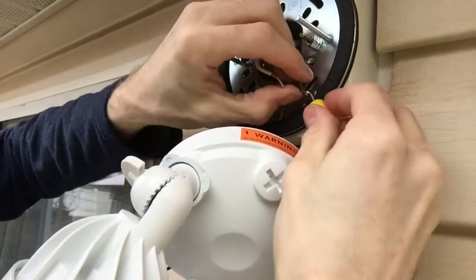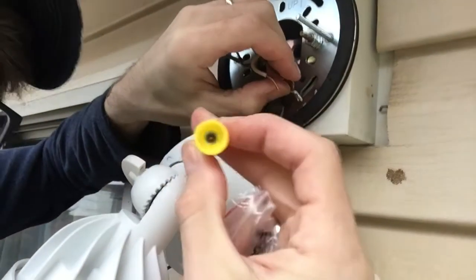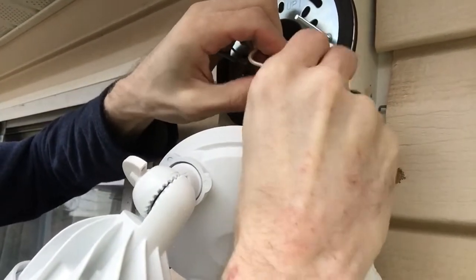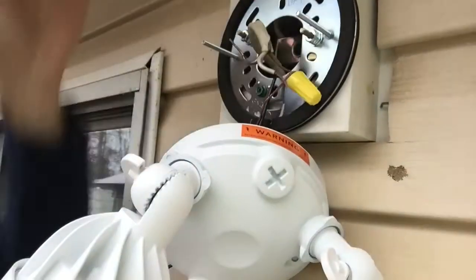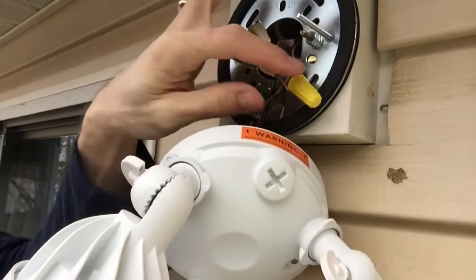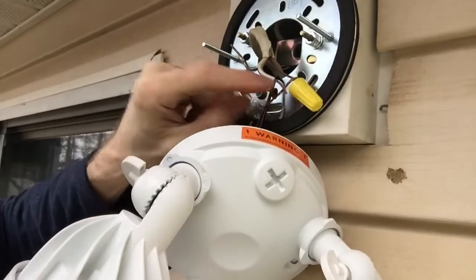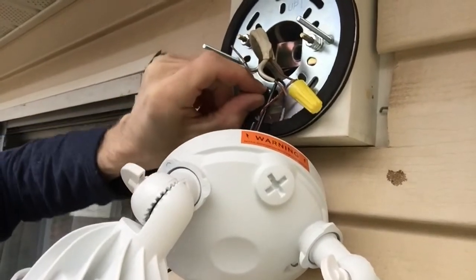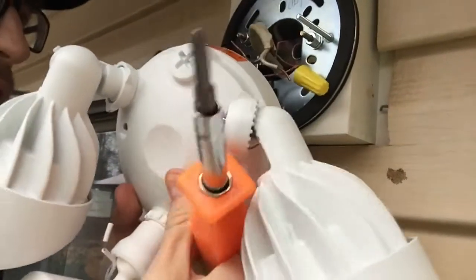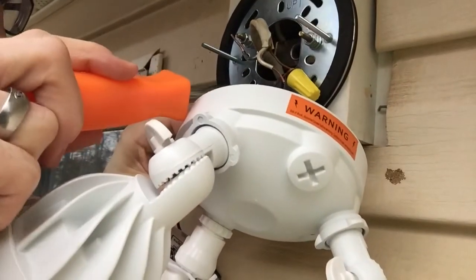I just kind of wrapped it around itself a little bit, but then we're going to use the wire nut. Basically how it works is it just has this thread in the middle — you're going to stick both ends in the middle and then tighten it. Now that we have the copper wire from the floodlight connected to the other copper wire — that's our ground wire — we need to go ahead and connect this ground wire to the ground screw. Literally all we're doing is just wrapping it around this green screw, just so it has a strong connection, so everything is grounded.